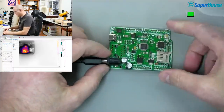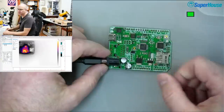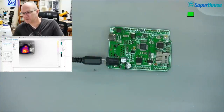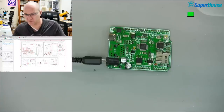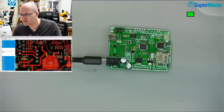All right, so next thing I can do is try putting power onto the output of the regulator from the lab supply at 5 volts, and we'll see what happens. That'll bypass the onboard regulator and tell us if the short circuit really is downstream of the regulator. So, which is the pin for that?